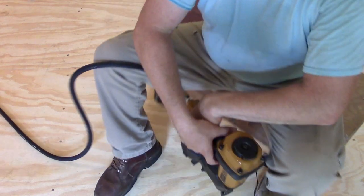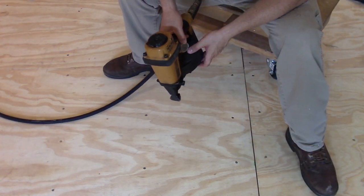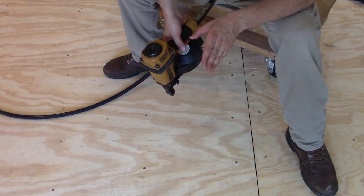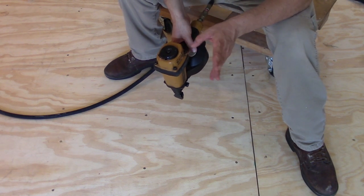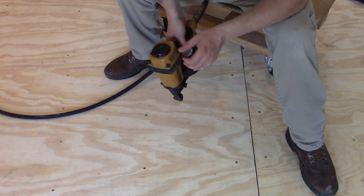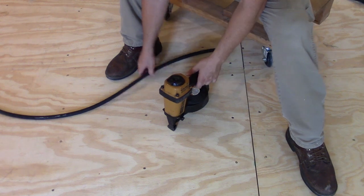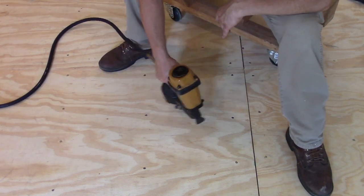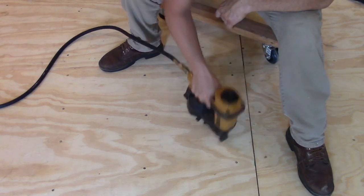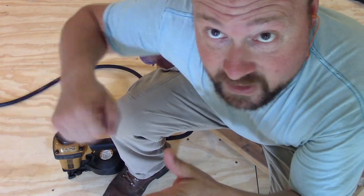So hook up your air hose. Now your roof nailers are cool because they're made to really just hold the trigger and tap. So if you have an underlayment you're installing or something like that, that's why they're really useful — even though I hardly ever use this for a roof. I had an older gentleman I did a job for and he gave it to me as part of my payment — because he used it once for his roof and then obviously never again. So just hold the trigger down. Your safety is all on the trigger — you can just tap it. So much quicker with that. You can lay the sheet down — ta-da-da, ta-da-da, ta-da-da. Awesome.